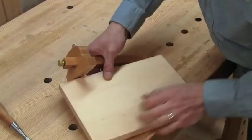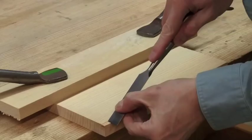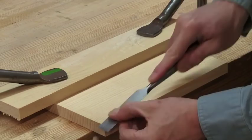The way you do this with a chisel is using the chisel bevel down. You start right at the end, lightly taking a shaving and working your way back. What you're trying to do is establish an initial step, an initial shoulder. Notice I can take advantage of that levering action of the chisel to lever it out of the cut before it goes too deep, but I can go all the way down to that gauge line.